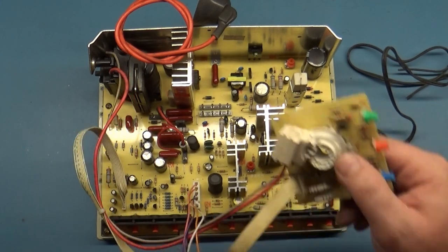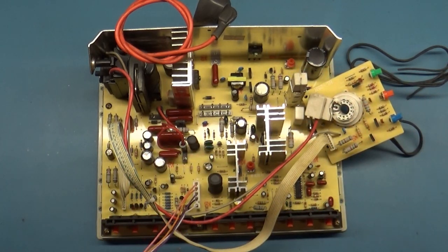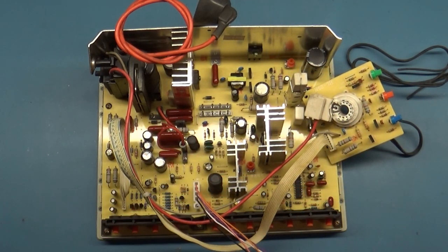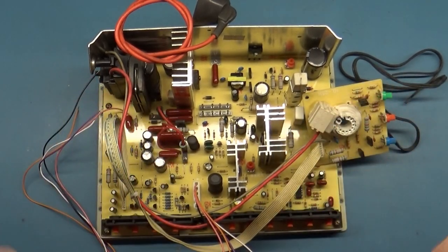Make sure you use the isolation transformer. Make sure you inspect everything, and it should at least turn on. Again, I can't guarantee longevity. You'll have a much better chance at longevity if you replace the cheap capacitors — which I'm going to do off-camera. I'm going to change all the caps out and see if I can make it last as long as possible. But for the purpose of this video, I'm going to show what you get right out of the box.